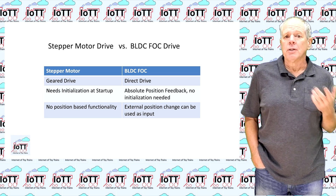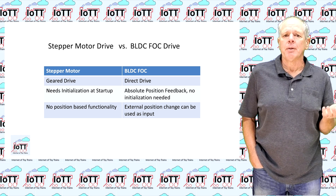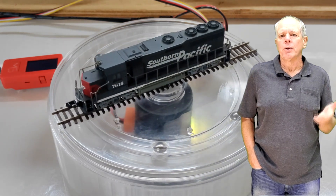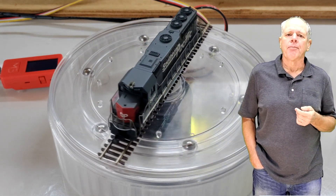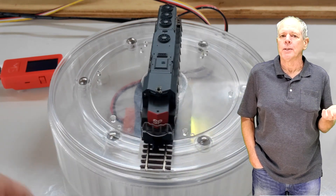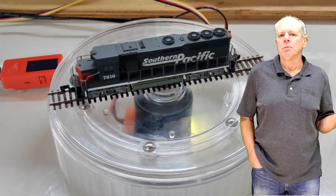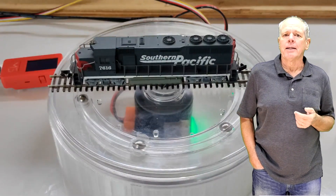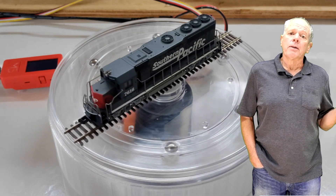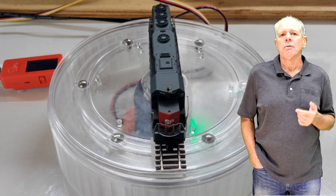The third implication of not having absolute position feedback is that functionality that relies on it is not possible with stepper motors. Here is an example: if the turntable is in a locked position and I manually turn the table by just a little bit, that small position change is reported to the controller and it can take some action on it. In my sketch, I programmed it so that if a deviation of more than 0.5 degrees from the locked target position is reported, the turntable turns 90 degrees in the direction of the disturbance. For a real application, this could be turning to the next track and it makes for a nice semi-automatic way to operate the turntable while moving locomotives to and from the roundhouse. No button push anymore, no turnout command needed — simply move the turntable a little bit and it will move in a controlled way to the next location.